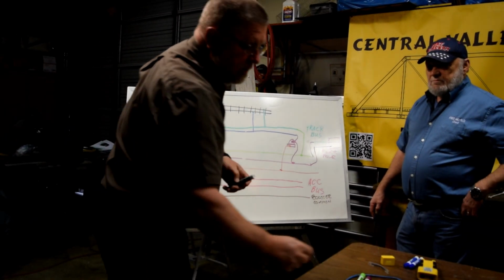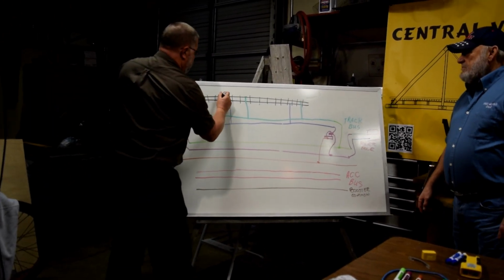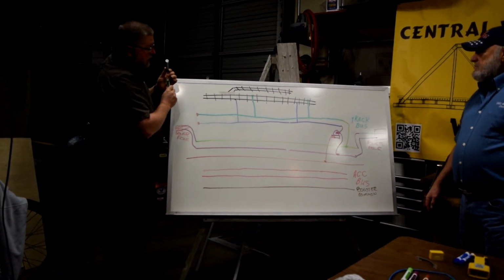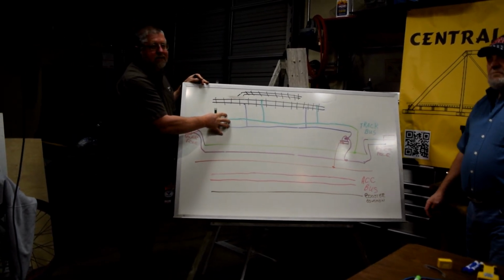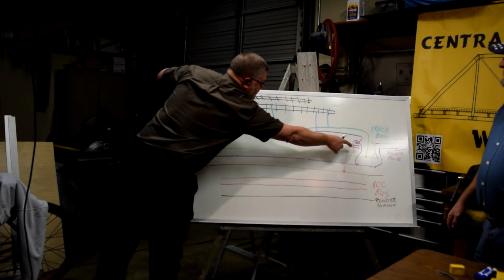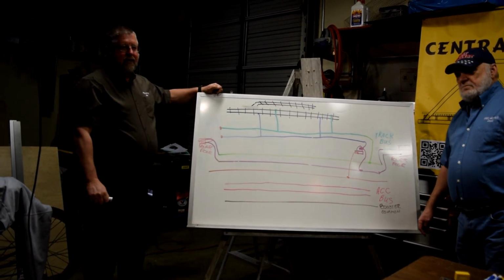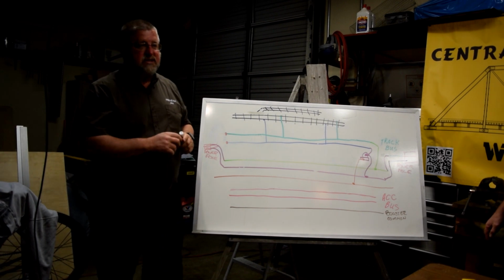If you have a siding like Harry was talking about, let's just draw a quick little siding in here. We have a siding. We're going to double insulate right here, and then we're going to power these tracks off of the main bus because we don't want to detect them. We don't want to see when they're flowing. Like I said, it's like a flow meter. How does the electricity get there? It comes down this wire, it comes through the BD20 and then into this track and up to this track. On this track, it's going to come through the power pole and go straight up here, never go through the BD20, so we don't detect that. Now, there are some other things you do in the MSS with a siding that we're not going to get into, because we want to talk about just a simple module.